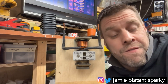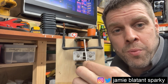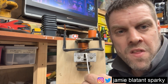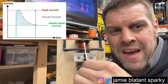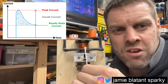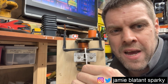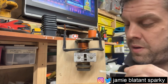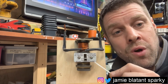Now when I start my motor, current flows down this cable, acts in here as a coil, comes out this cable and feeds the motor. Within here, if there's too much current, it starts to pull the shaft up — pulling it up, pulling it up — and if it gets above this bit of metal it trips. In normal operation, starting a 20-amp motor might pull 120 amps initially; it starts to pull the shaft up, but then as the motor starts to spin and the current reduces, the natural gravity and suction of the oil drags it back down. If it overloads, it pops out the top and trips the circuit.